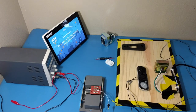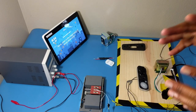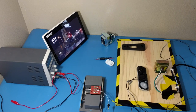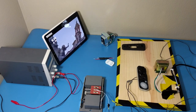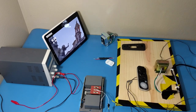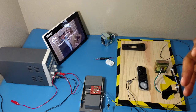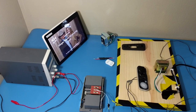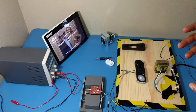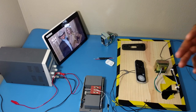Going into installation, I always advise you to install from inside out, not outside in. What does that mean? Install the chime first before you install the video doorbell. So the sequence is: power off the circuit breaker, install the chime if you need to install a mechanical chime, and then go out and install the doorbell before you power on.